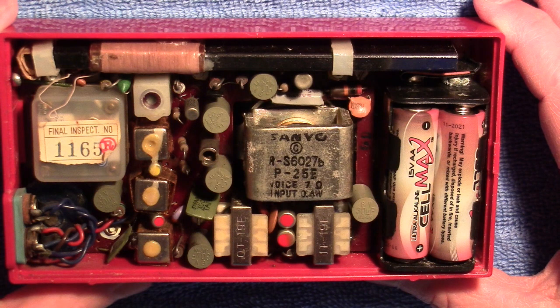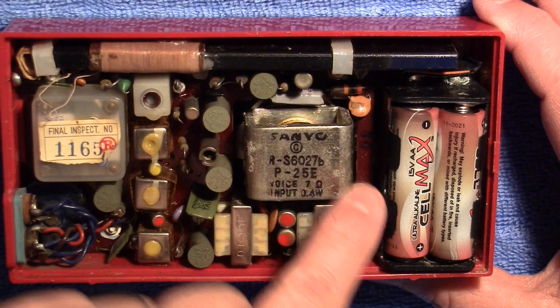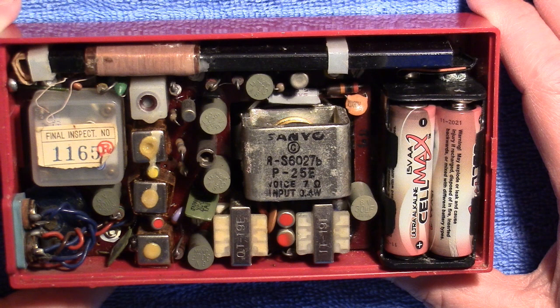Then I got to looking at it and I noticed the capacitors — looking at these capacitors here, they're 30 microfarad, six volt capacitors. And there's one, two, three, four, five, six of those. And there's another electrolytic down in here, and they all are the original caps.